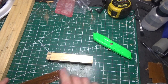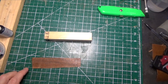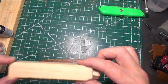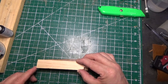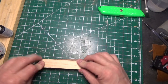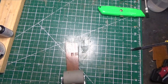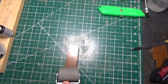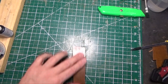Looks like it's already dry on that one. After we get done with this we're going to test the glue method. Okay, we're at the 15-minute mark here and we're going to apply the two pieces together. The way I'm going to do this is I'm going to put the piece of veneer flush and actually apply the piece of wood to it — that should help me get it where I want it. I've got plenty of room on that side, so here is where we just need to make sure we're aligned correctly. Now we're going to take our little roller and roll it out, making sure we get any air bubbles out. We're going to pay special attention to the edges. And apparently it's done — there's no more drying required.